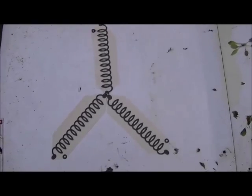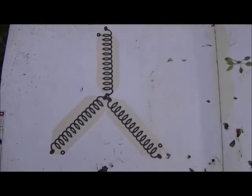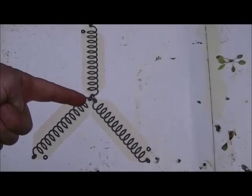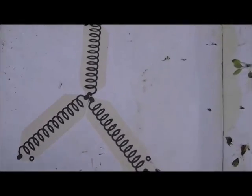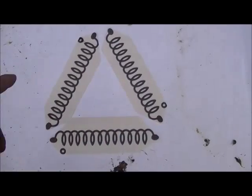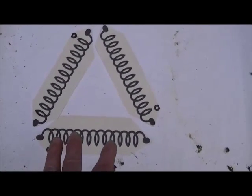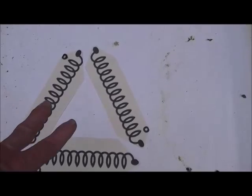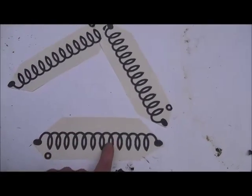Here's your configuration for 208-volt three-phase. If you look at the center, that would be your neutral. If we're going to make this 120-volt three-phase, we have a tap here, a tap here, and a tap here. Each coil is 120 volts regardless. If you take two coils and read the voltage on one, it'll be 120 volts.